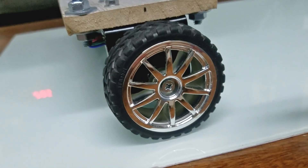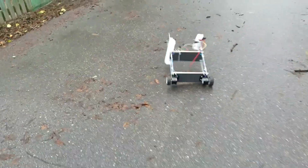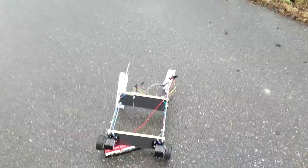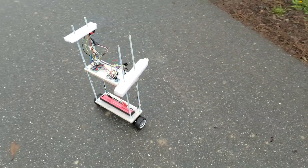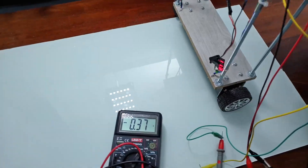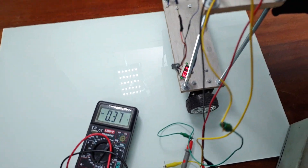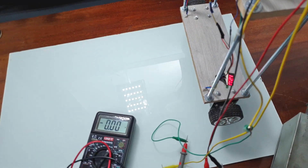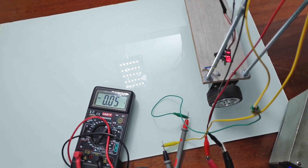Although I managed to make the robot balance, the project was far from completion. I was faced with a problem: the robot falls very often, even on flat surfaces, and the problem was not related to balance. The problem was the stepper motors — they simply could not rotate fast enough. The faster they rotate, the less current they consume. The less current they consume, the less torque they provide. So even at a relatively low speed, the motors could not provide enough torque.